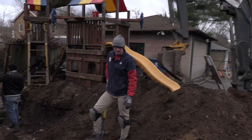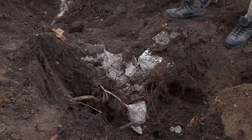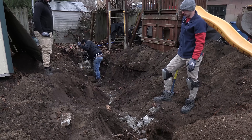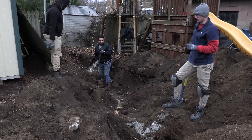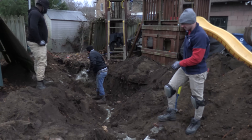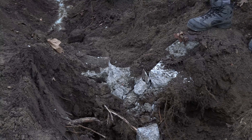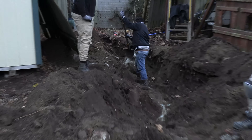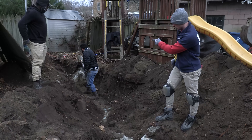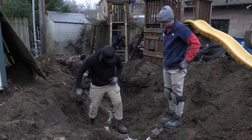Our trench path is still here, however we hit something with the trench right here. Now that we've dug enough out, you can see the smooth edges of a fully concrete water feature — some kind of pond. The bottom is right at 36 inches deep, which is what we need. We've realized we don't need to crack all the way through it, but the lips of the pond are certainly too high. The two options are to drill through it with a diamond bit we don't have, or smash our way through it — which unfortunately we are capable of with enough effort. Steph and I are going to fire away at this wall.